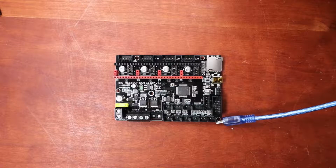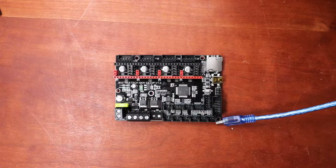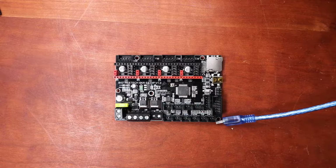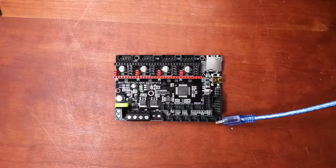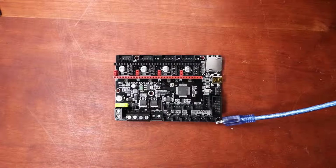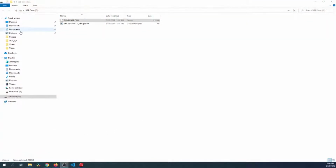So what we see here on this drive, it looks like they've got a G code for something. So that's a printer file of some type. And then they have a firmware.cur. So what we need to do is actually place, so I'll actually put this where you can see it because I'm talking too much without realizing I didn't change screens. This is the drive right now, fresh out of the printer board as it came. So it says firmware.cur, and then it's got a G-code file, which I think is a test print. So we're going to place a new firmware on there.